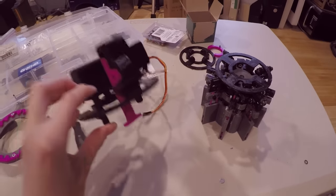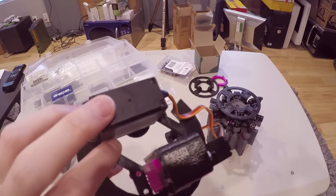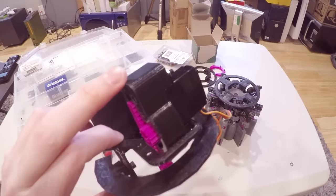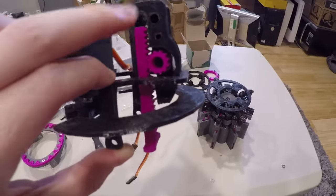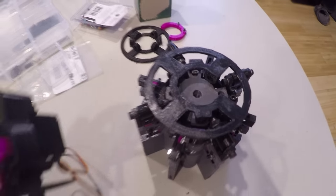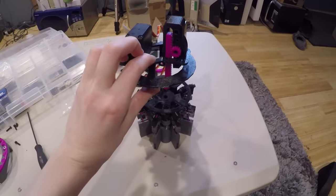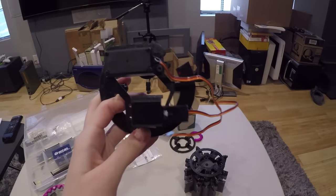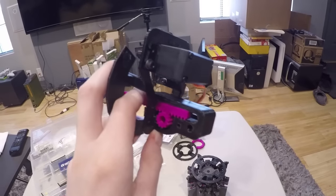I'm going to hold this up. This piece right here has two motors mounted to it — the one that drives the planetary gear system, and this new one I just developed this week that is going to hopefully drive this rack and pinion to press that bit in the middle downward. If all goes well, this assembly will mount on top of the mechanism, and both motors will drive the separate systems, keeping the center clear for the fluid reservoir which will contain Noodle's juice.